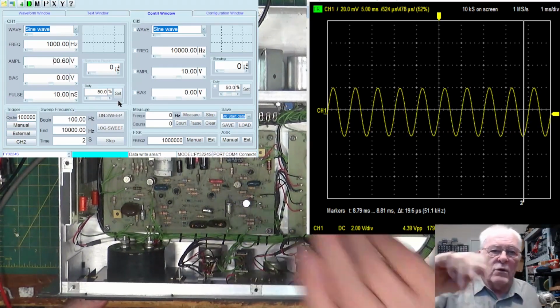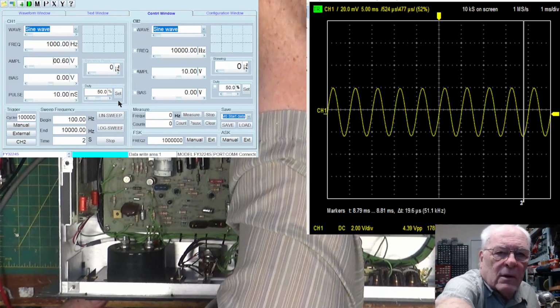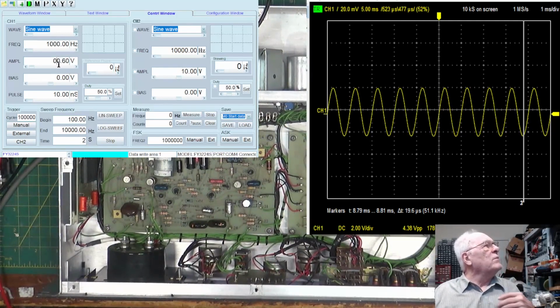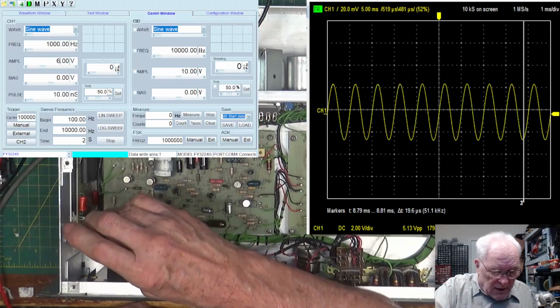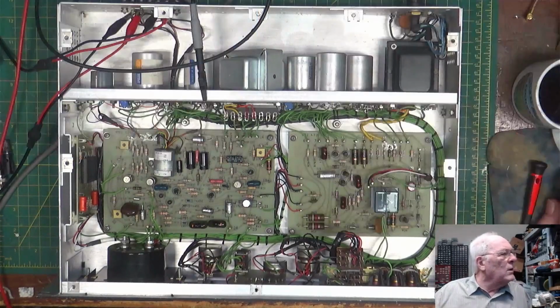All right, so 0.6 volts on my meter is reading minus 13. Okay. So that means I got to go to plus or minus 3. So we'll take this up. Minus 3 should be, I don't know, we'll try 5. Yeah, that's 4. Try 6 and get, whoa, didn't like that. Try 6. There, minus 3. And we adjust R60. Get the camera going for the DroidCam. All right.